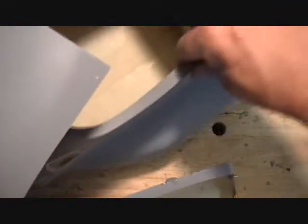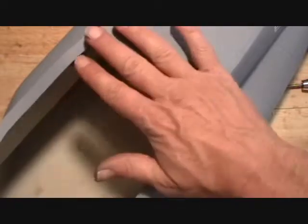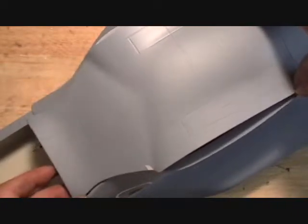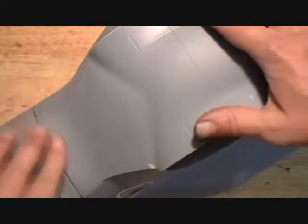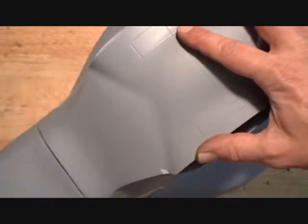Now when your wing is installed, this kit has it, I've been putting blocks of 1/8 inch plywood underneath these two screw holes. When you get your wing installed and you drill these back two holes for your over wing fairing, those will be in place, and this will just kind of be sitting here loose. And then when you install your canopy, that'll lock that all in, and that'll be nice and flush and nice fitting, and it's a lot easier than the screw together method that I used before, and works really well.